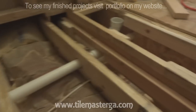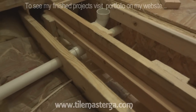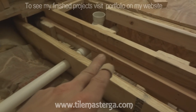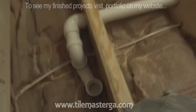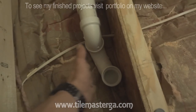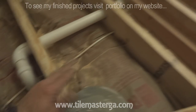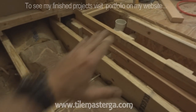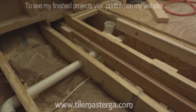We also have a block on the back wall three inches lower from the original floor height. This is where the shower pan is going to start - transitioning from the regular floor height to three to three and a half inches lower. We relocated the drain; it used to be over there, now it's centered and pushed slightly back against the back wall so most water stays there, minimizing chances for water to escape since there will be no curb.